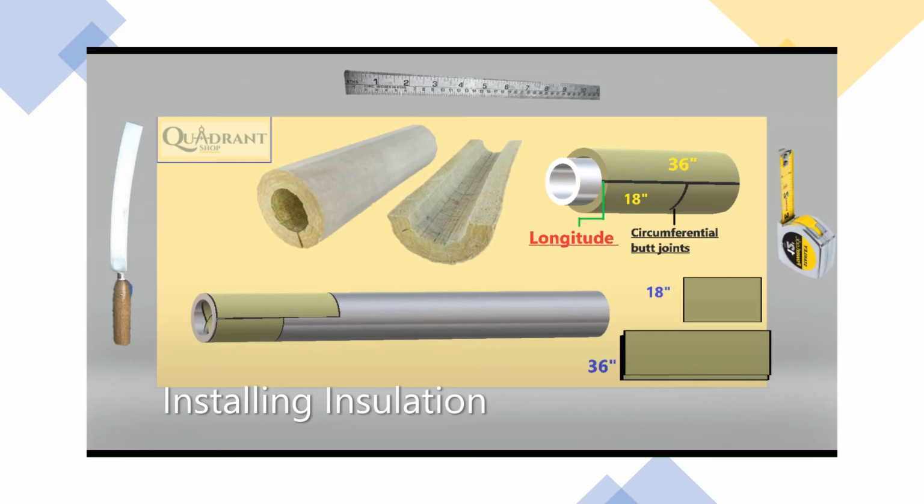So you see this piece right here. My full piece is 36. That's how it normally comes. And I have a piece of 36 that is 18. Some insulation is heavier than the other, like calcium. You don't want to start with the heavier portion on the bottom while you're trying to put a band or a wire on it, right? So keep in mind that you put the larger, heavier piece on top, and the lighter piece on the bottom, and then you wire this, right? And you have a continuation. You put another piece here.